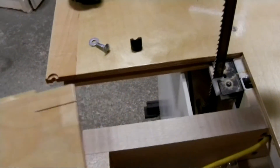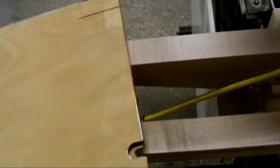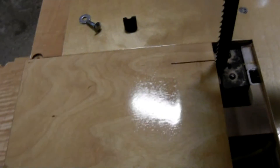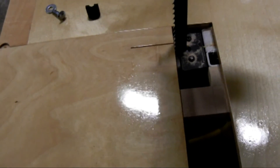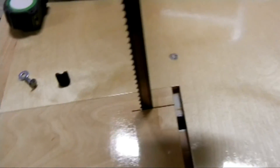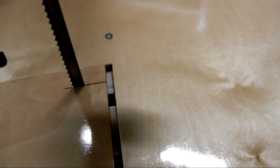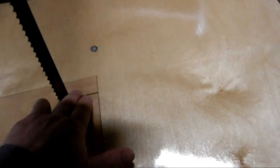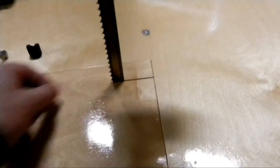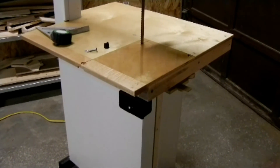Here's a look at the table. I took the time to make this so that it's slotted to fit in here. That keeps it flush and in line, and it has a zero clearance slot there for the blade, so that when it goes in there's no room beside the blade for stuff to go down. And that's it — you can read more about this at I Build It.